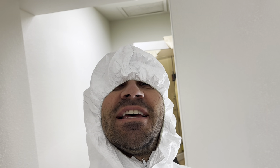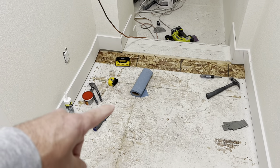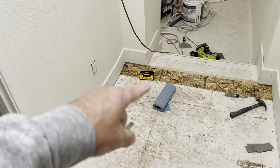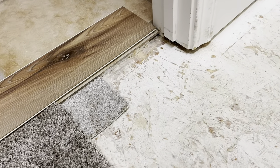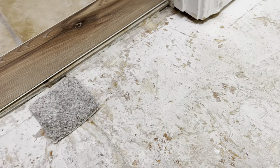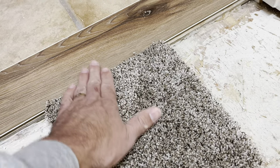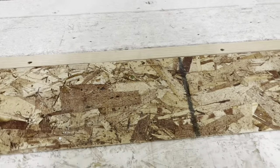I'm going to hit it up with some primer right now. We're all painted up and the baseboards I'm putting in right now. I decided to remove the flooring from in here — even though that would have made a better transition across the step, it created a problem. The reason I removed the floor is because I wanted this transition from the new floor to be a little smoother. The carpet and pad are going to go here so it'll be more at the same level as the new floor — smoother transition.